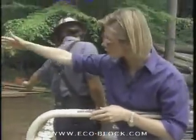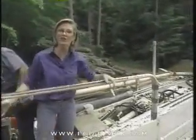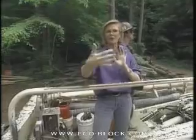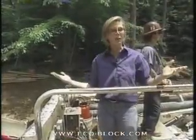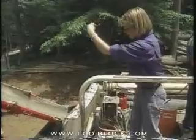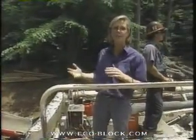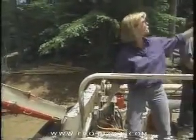The whole process starts with the concrete truck — the concrete rolls from that truck into the hopper and is sent into the pipes, up through the boom, and into the walls. We're looking for five or six cubic yards — a yard is about three feet by three feet by three feet. This truck has about seven or eight cubic yards, so we have more than enough. If we ran out, we'd send the boom up over the hopper and circulate the concrete until the next batch arrived, so we don't clog up the booms.